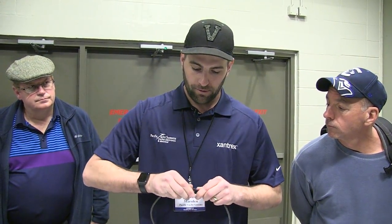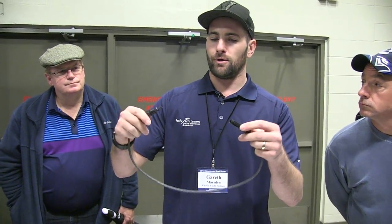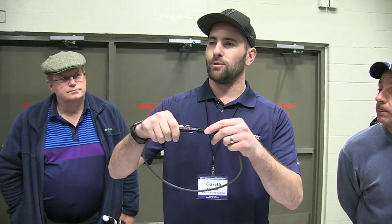And then when you have your panel up on the dodger, you just plug it in, and when you disconnect, like that. But as I said, when you go to store a solar panel, don't plug them into each other, because if you bring it back out into the sunlight, you'll need a new panel. Disconnect under load, is that just about sparking and arcing? Yeah, so the best way to disconnect your solar panel is to cover it with a towel or something, so it doesn't have any load trying to charge, and it's like turning a switch.